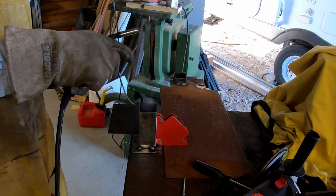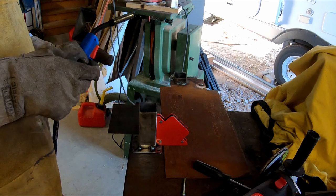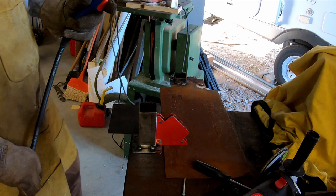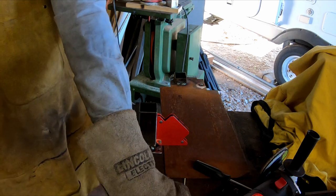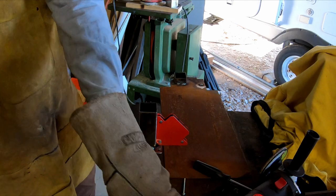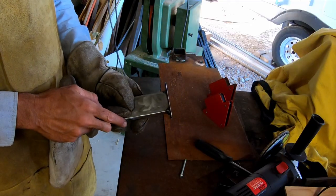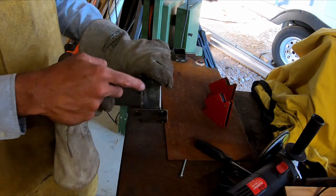You have to tack all the way around. When adding heat, things start to expand and then contract back further than where they were before, so things won't lay flat. I just have to work my way around and hold it all in place, then I can do all the welds and fill in. It's kind of funny that it's a bit of an effort to hold things in place and keep them as you intend. There it is, tack welded into place — now I can proceed to fill in all the gaps.